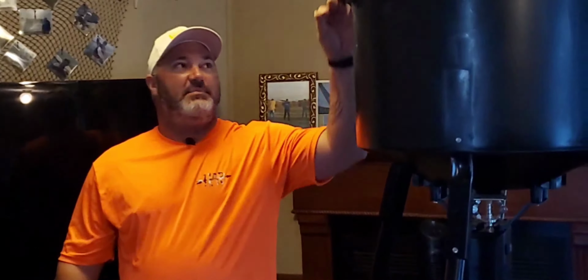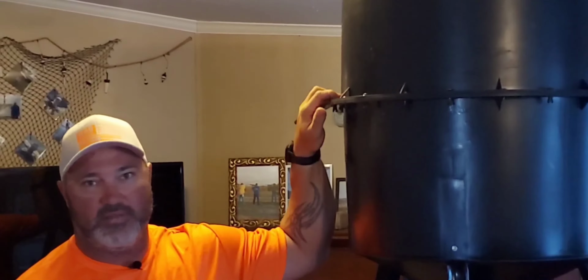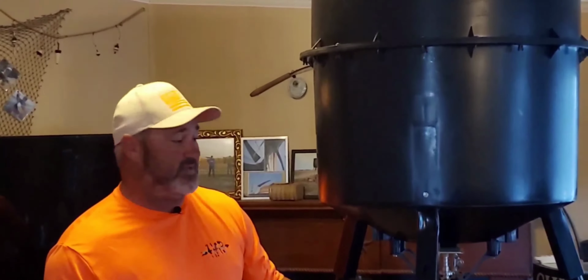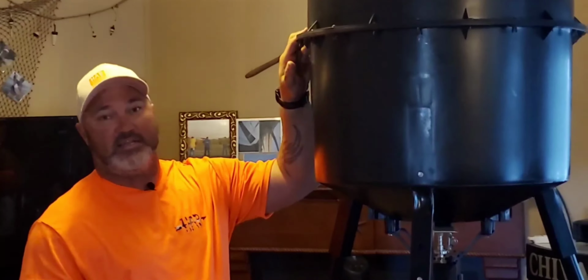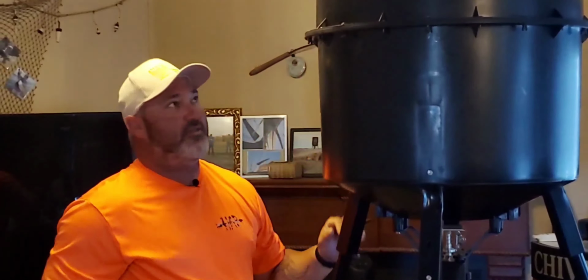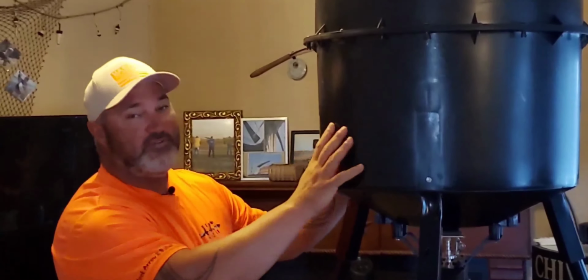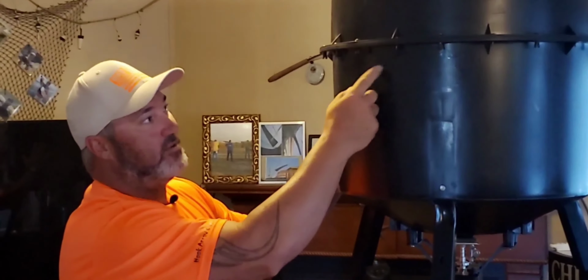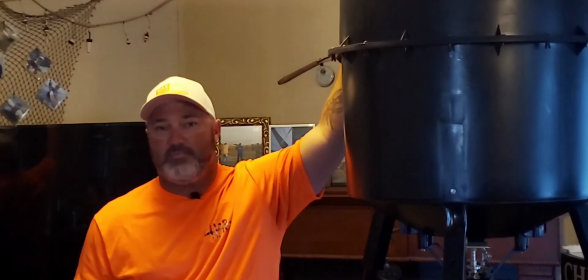So to recap this video, all we did was use some silicone and some screws. I mean, nothing spectacular. I used the Lexel because it's what I have around. That's the stuff I buy all the time. I prefer it just because it's a good sealant and it's an excellent adhesive. So it helps keep everything together, keep the moisture out. If your screws back out, it will hold. Literally, if you've never used this stuff, when you try to pry it off, it'll actually peel some of the plastic with it. It's pretty tough stuff.